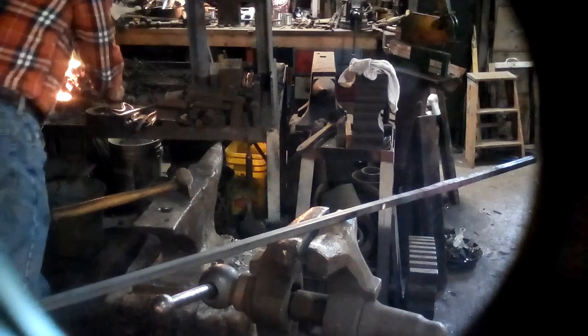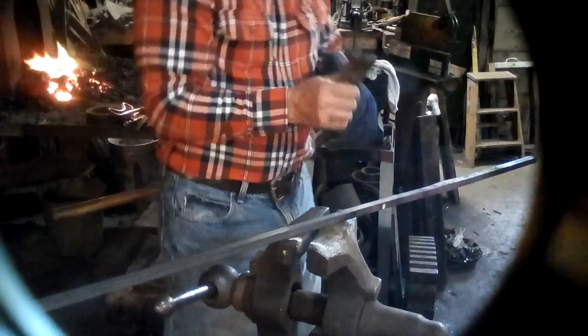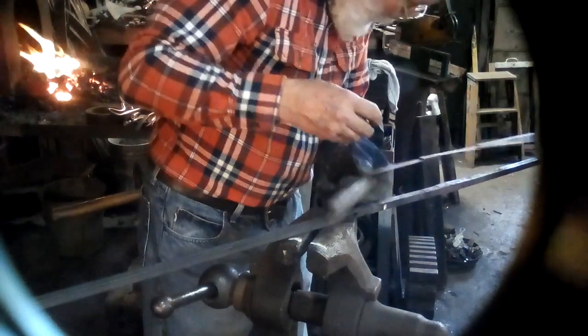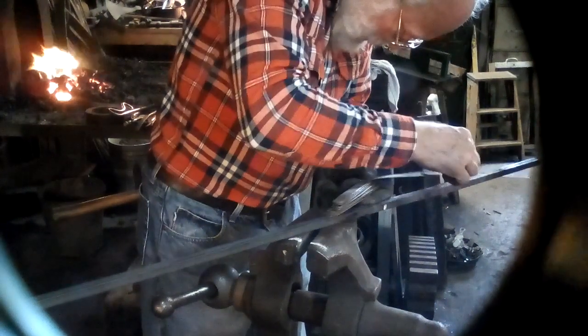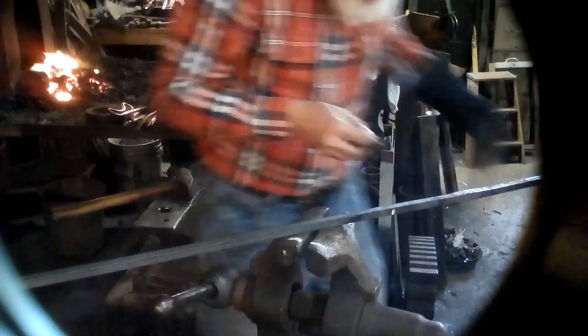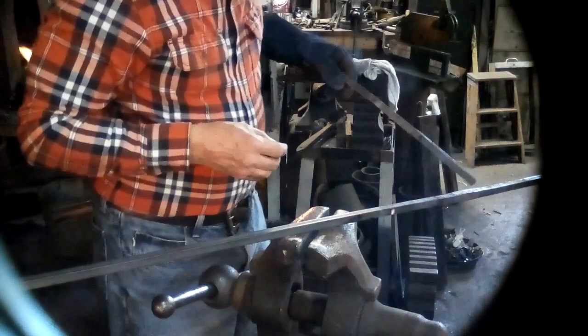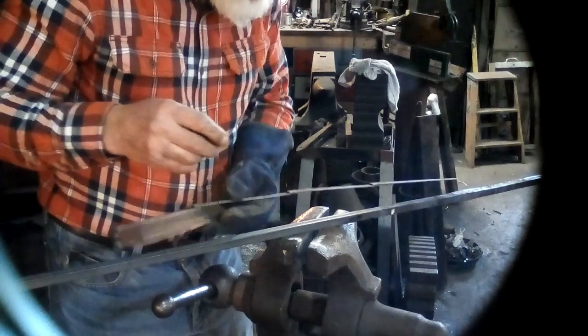Now, I have said a couple of times so far that what we want is to have a square corner that's in a specific location. So in order to do a specific location, I am going to measure my 12 inches and say that that's where the outside of the bend should be, which means, because you have a half inch allowance for the thickness of the metal, that is really where you want the inside of the bend to be at 11 and a half inches to get it to be 12 inches along that side. All right, and it's the same problem.